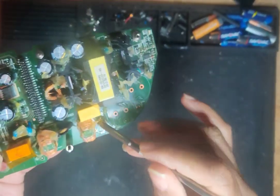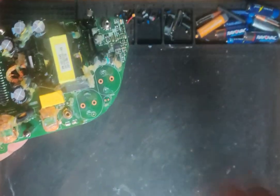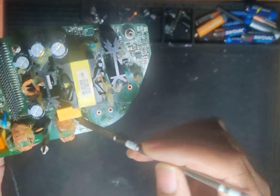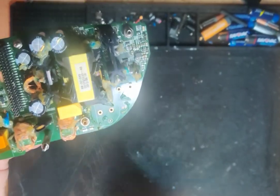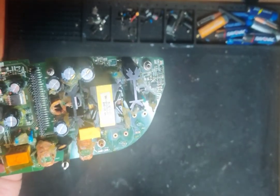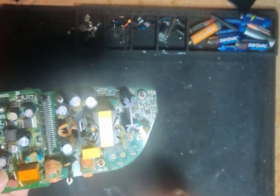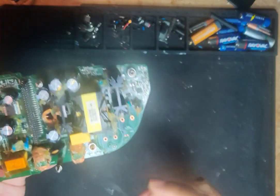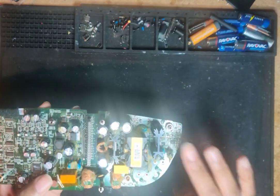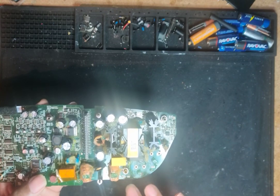You'll notice two of these resistors are white because I flipped them over after putting them back — there are two on one side and two on the other. I was getting open or mega-ohm readings on them. It wasn't obvious at first, but once I started testing it became clear. So if you have no voltage going to your chip, that's when you go back here and check whether those resistors are good.